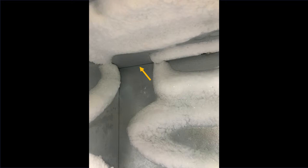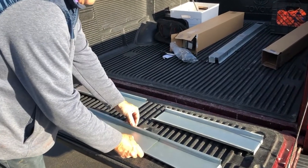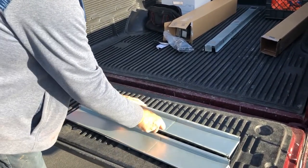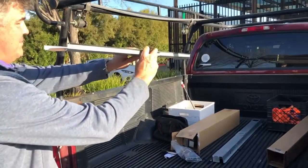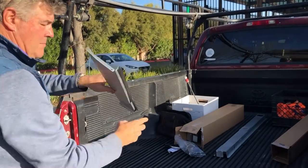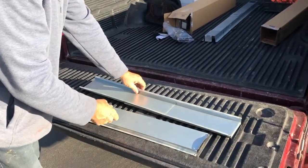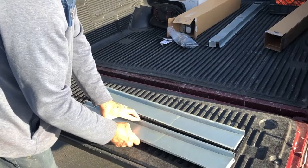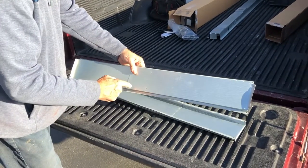The bracket consists of four parts. They are two pairs of telescoping metal panels that will be secured to the cold wall merchandiser by fastening screws into the ceiling and wall joint. Place the pair of telescoping brackets together until they are flush with the front and back wall. Once you have determined the interior depth of your particular freezer front to back, mark the bracket with this measurement. Now using the four screws provided, screw the brackets together according to your particular measurement. Do this on the right and left side.